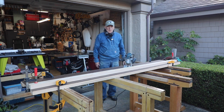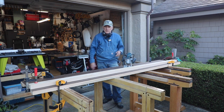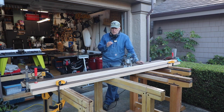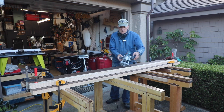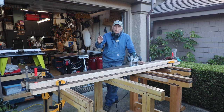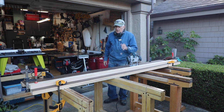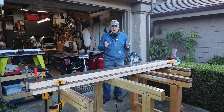I had a battery run down on me so I lost my audio, so I'm going to do a voice-over here. This is my eight-foot track. To review what we did previously: we screwed down from the underside a one-by-six, eight-foot-long board to the top of particle board. Now we're going to cut a dovetail groove down the center of the track — the one-by-six board. We were careful not to put the screws where they would interfere with the router bit. I've laid it out on some sawhorses and used an eight-foot-long board as a track guide, set at the right distance so the center of my router bit would run down the center of my track.